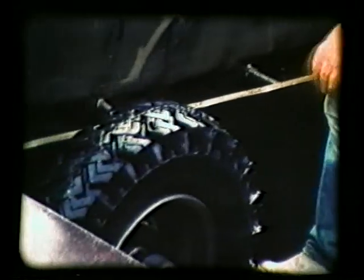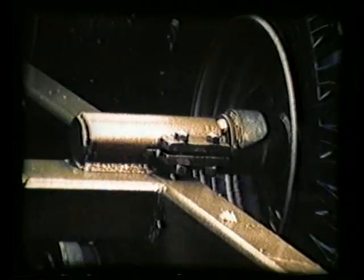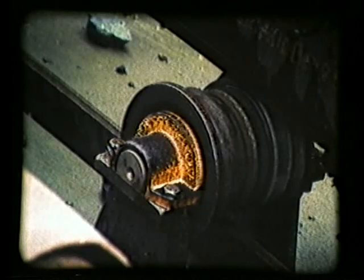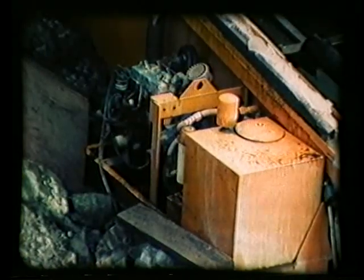The internal parts of the machine are laid out in such a manner as to allow no build-up of material, or places where heavy particles may accumulate. Inside, the D-Rocker is constantly washed clean. Heavy wear components include specially designed wheel hubs with duocone seals, and fixed caterpillar undercarriage rollers. The unit is powered by an air-cooled diesel engine.